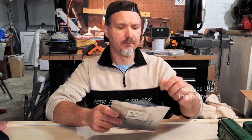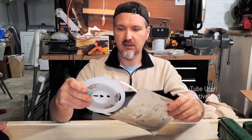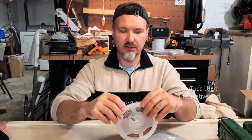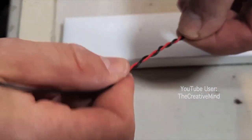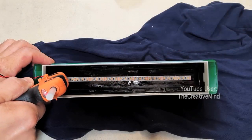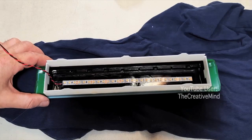The weather changed outside and got colder, so — sweater. The LEDs I've chosen for this project are from SuperBrightLEDs.com — 16.4 feet of LED ribbon with 3 LEDs per inch, cuttable in 1-inch segments. I soldered on 26-gauge wire, twisted them together to keep them in place, and once the ribbon was set into position, I hot glued the wires onto the top of the passenger car lid so there's no stress on the solder joint — only on the wire itself.